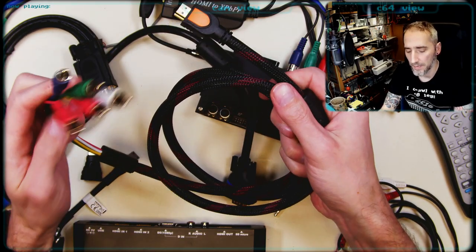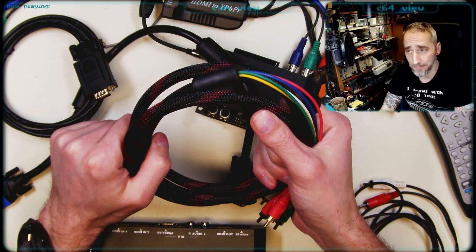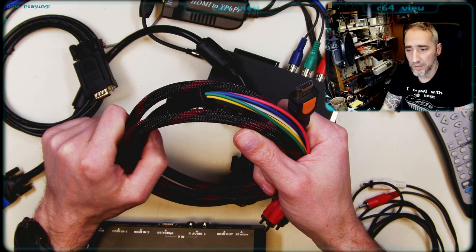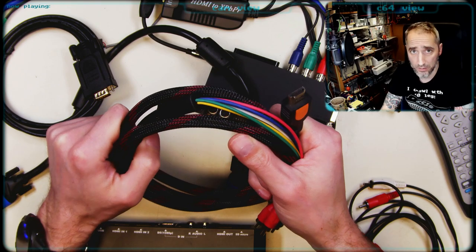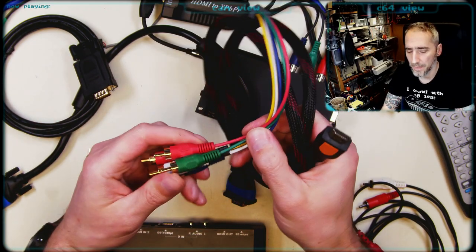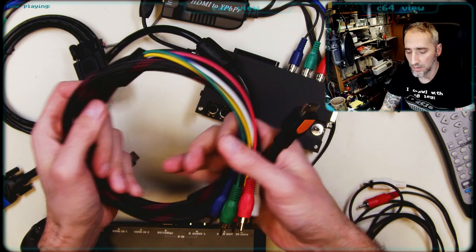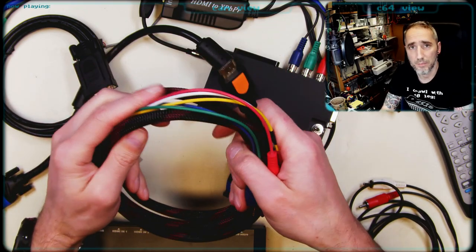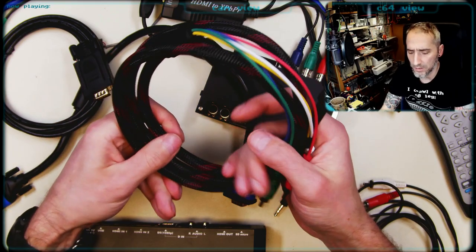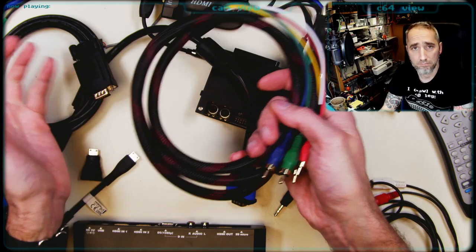And the reason for this is that back in the time of DVI connections, so that's the bigger part compared to HDMI, you had a chance to route audio to the DVI port as well as an analog signal, and the component signal as well. But this is not available for HDMI. So passive cables like this are not working at all, and not worth even a single cent or euro. And I bought this quite a while ago when I was testing different capture devices, and I was really surprised to see that they make basically no sense at all.